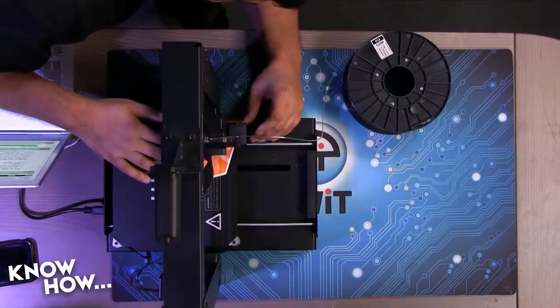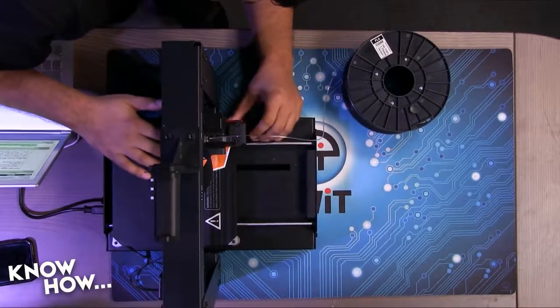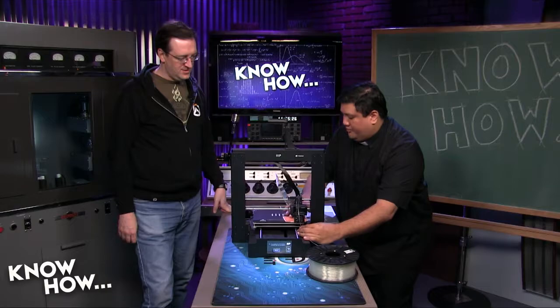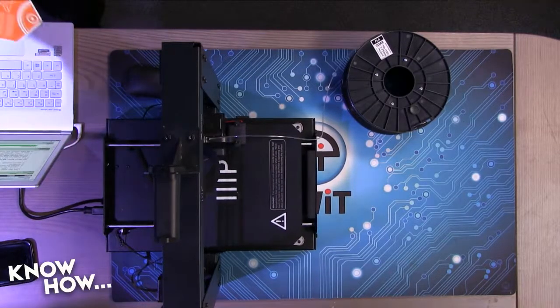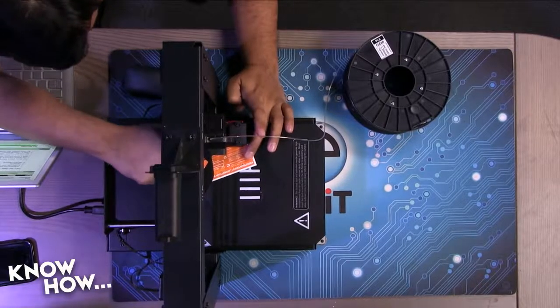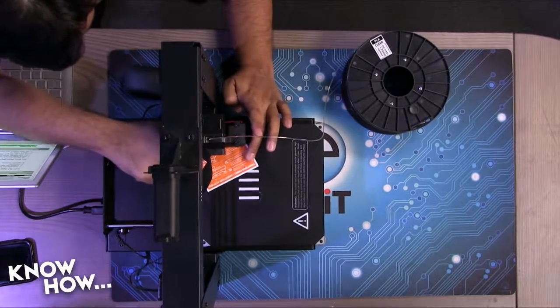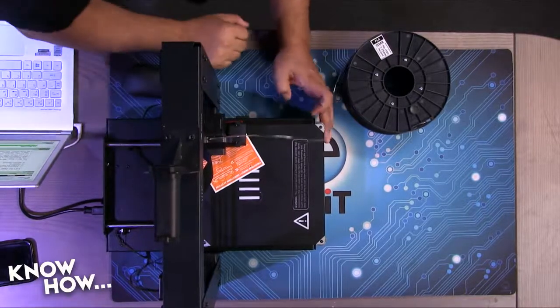The other fix is a hammer or a pair of pliers. So now I'm starting to feel a little bit of tension — there we go, now it's grabbing. I'll pull it back — that's about right, that one's perfect. Let's go to the next one. Same thing — I just loosen up the screw until we get a little bit of tension. I noticed there are burn holes in your leveling card. Sometimes I do this when the head is hot because I get impatient and just want to get it done.